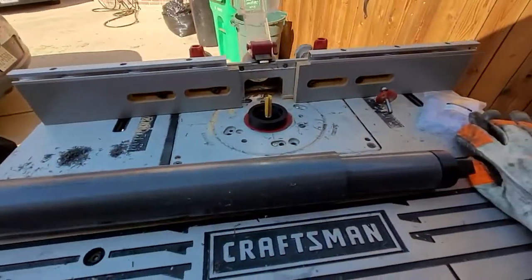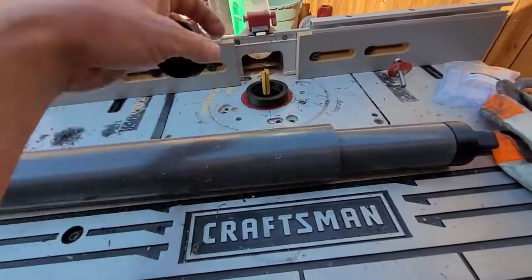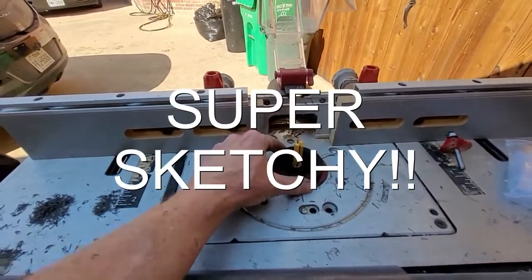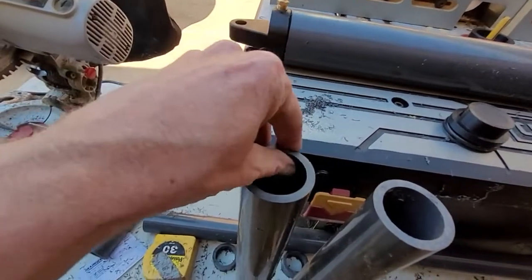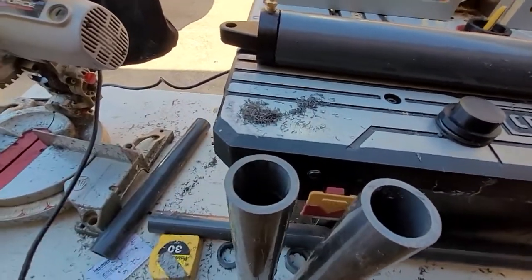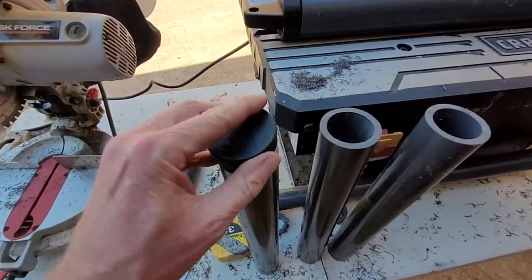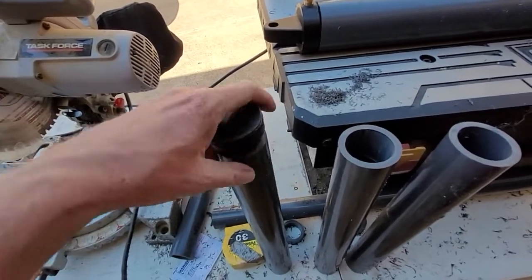So what I'm doing is I 3D printed this piece right here — it's my jig. It goes on the OD of the tube, because the OD is exact. And then I just run it around to machine out the ID as needed. Once I have that done — here's one I've already done — this piece will now fit in it. And it is a snug, snug fit.